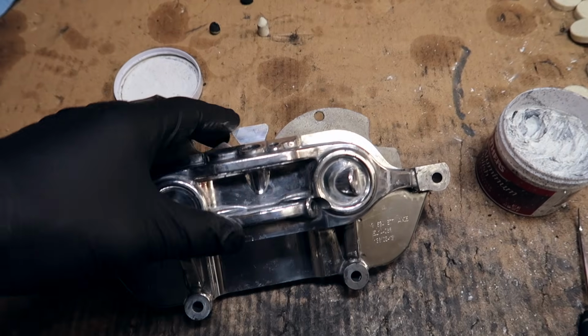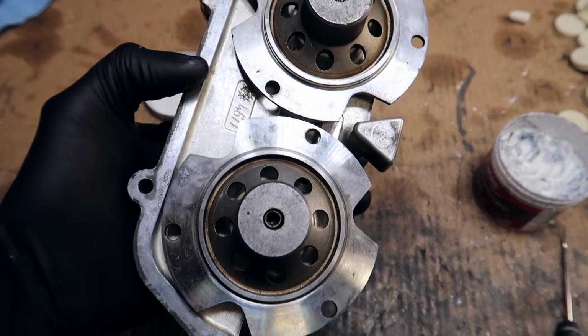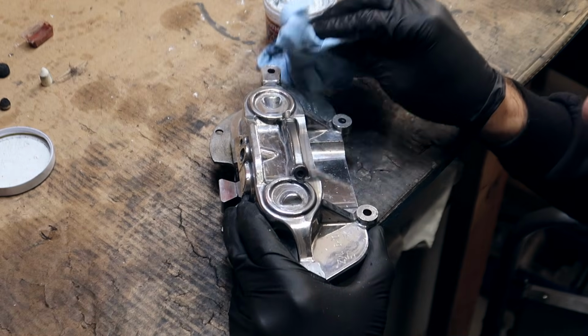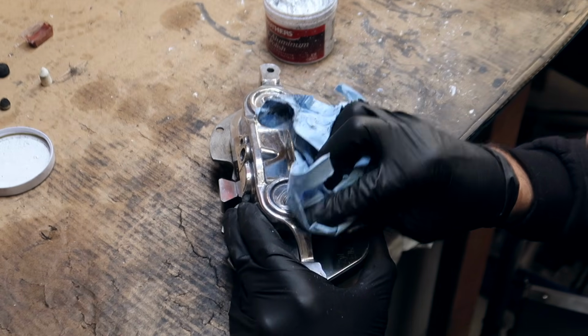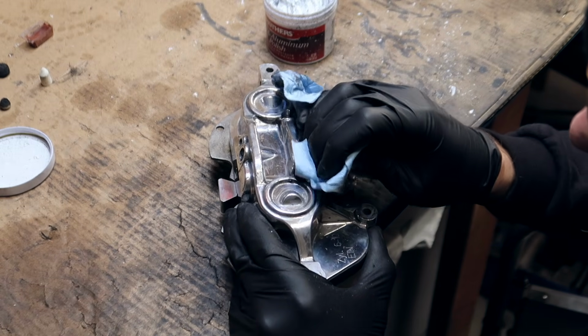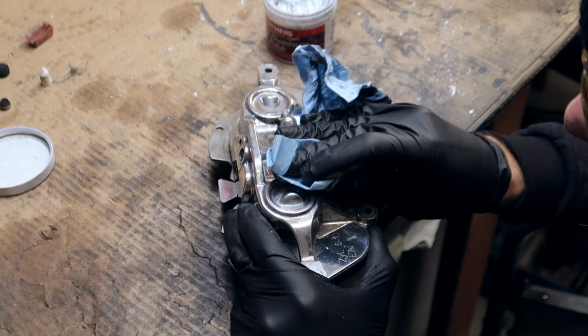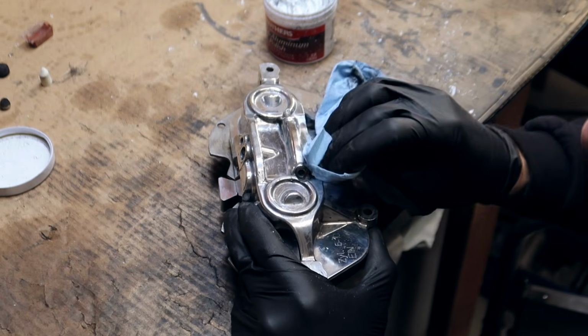At that point, take some sort of cloth material, wipe it all down completely, clean up this area right here because you don't want any of this polish and buffing compound to go into your engine after that. At this point, it's very important to buff until the buffing compound becomes dust. Don't leave any wet residue. That's the biggest thing, because that wet residue becomes very difficult to clean up unless it is completely dry and it dries itself out as it goes, you know what I'm saying?